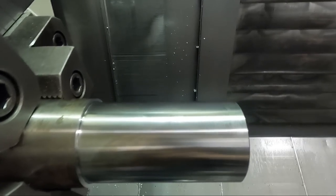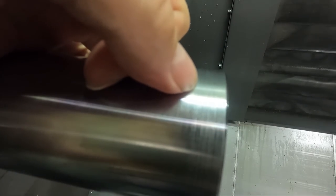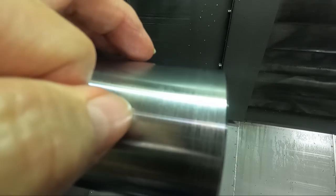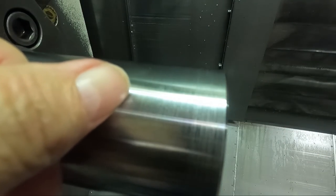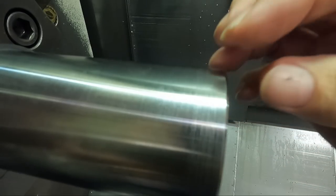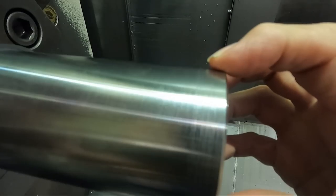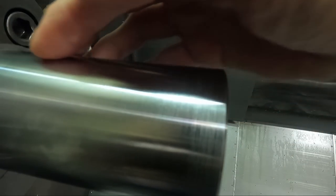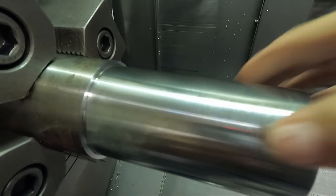I don't know if you can see that at this angle. Maybe that's a little better. You can see the first half an inch at this shallow depth of cut was having problems, and maybe the next two gets up to about here from what I can see. It might be hard for you to see with the camera, and it starts to get better from then on. So let's see if at the proper speed this doesn't make any difference at all. It didn't the first time I ran it at 5,000 feed, but let's just see at 2,500. Just feeling the finish up here, it feels real good.